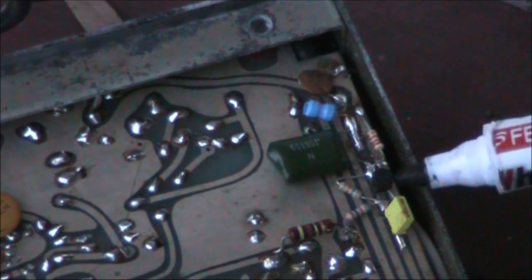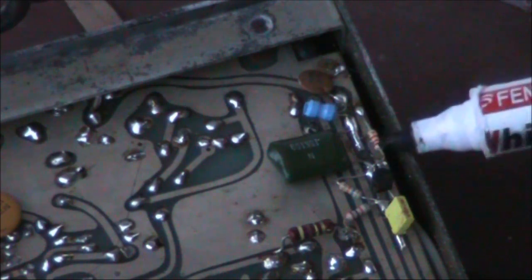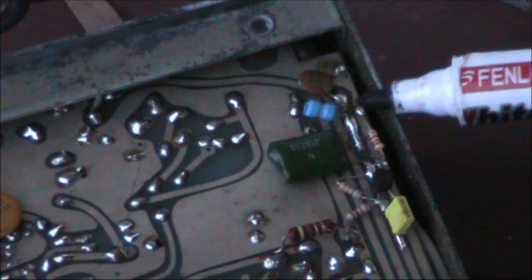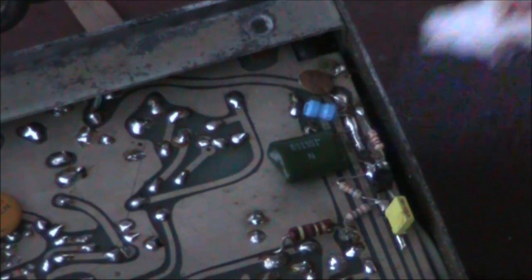Another thing I did was add an extra audio amplifier on the bottom of the printed circuit board, just for the microphone. That made the audio much more punchy and gave very good reports, even though the transmitted signal strength wasn't all that high. That's exactly what you want for a low-power AM rig — not overwhelmingly strong, but quite listenable.